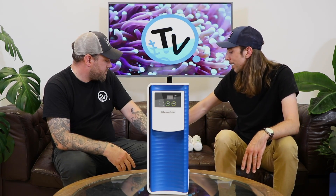It gives you a visual indication so you know when to change the cartridges — useful since it's easy to go longer than you should. For sediment and carbons, Glamorca suggest between four and six months. The DI resin is roughly six months depending on your TDS, and the actual membrane itself is about a year. All of those spare parts are available when you need them.